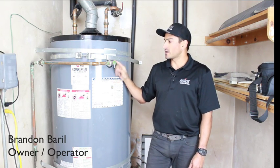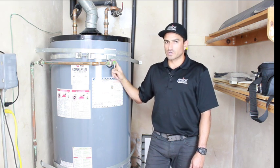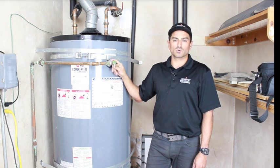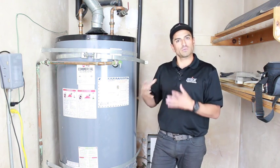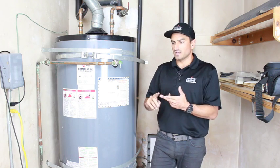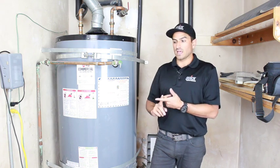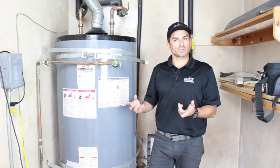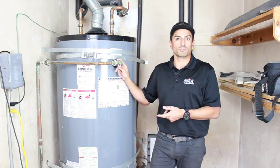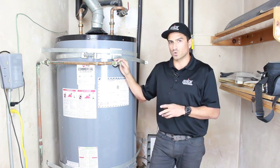Today I'm here to show you how to change out your temperature and pressure release valve. This valve is extremely important to your water heater. It controls the amount of pressure that can build up in the tank, as well as how hot the water can get inside. If your tank overpressurizes itself, it can actually explode. And if it overheats, you're gonna burn yourself. So this valve is super important. It does those two things. We recommend that you check it at least once a year.